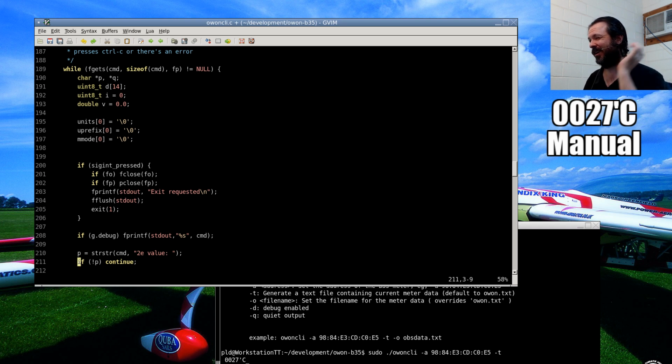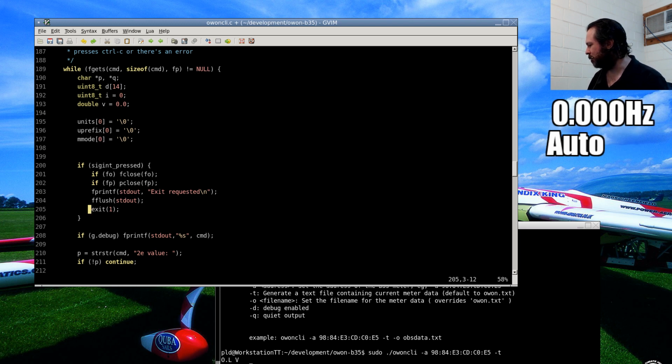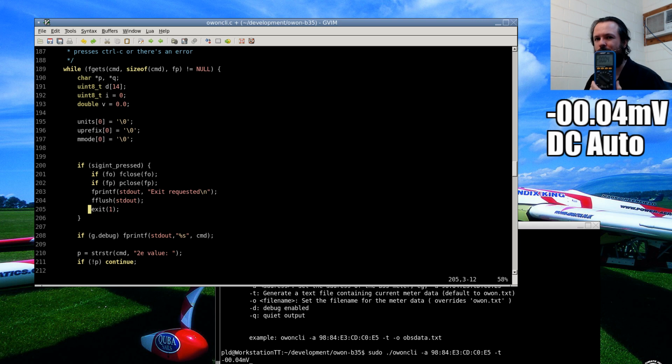Now, the other thing I've got to think about is the time stamping. The reason why time stamping is a bit of an issue on this, or could be, is I mentioned it produces about 1 output a second. Now, if I use the normal clock timer, which is like per second update, then there's a pretty good chance that over any given data set, there's going to be a degree of aliasing occurring where you will have 2 entries with the same timestamp on it. So we're going to need a higher resolution timestamp, something like a millisecond. We only really need a tenth of a second to make a difference, but we'll certainly have to read at microsecond level.